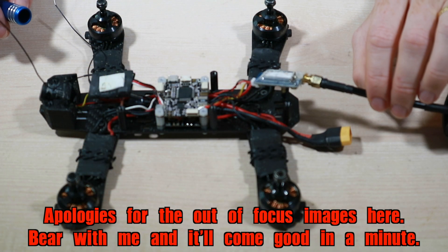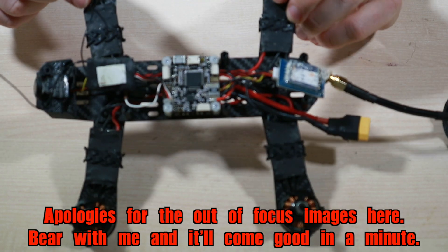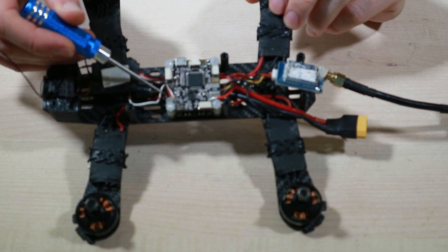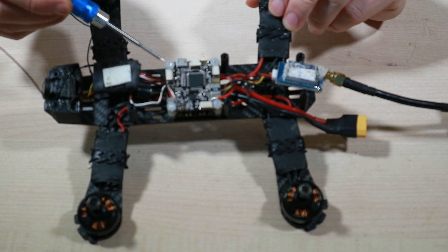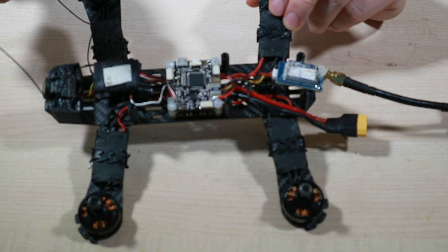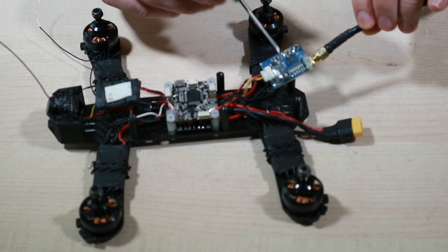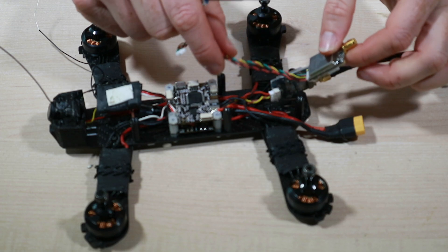Here's the quad with the top stripped off. It's got an Omnibus F4 on it at the moment and the only problem I have with these is the pins are really weird. I use S-Bus here which is actually UART1. It's also got UARTs 3 and 6 in here, but I don't know if one of them is off limits because I had to reassign one of the pins. This is my current VTX — you can see there's the push button there, and it would be really easy to see because it's got these lights, but of course I can't see in there.